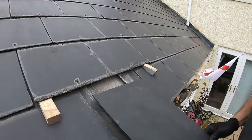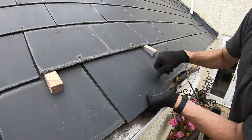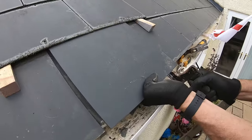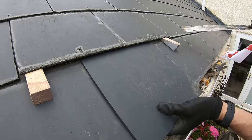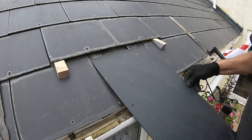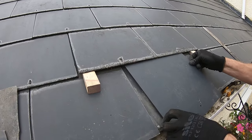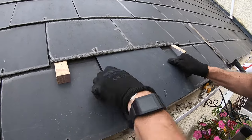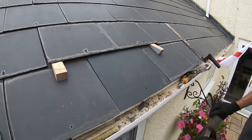So what we've got to do now is get this slate slid under there. The trick's getting it up onto the lat at the back. What you can do is use this and slide it under. Sometimes you just do it by hand, or sometimes it's easier to slide it — if you get it up on this slate like that. It's a bit of a fiddly bit, this is the most fiddliest bit — there we go, that's in.